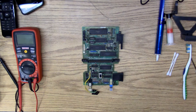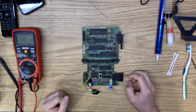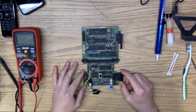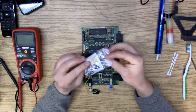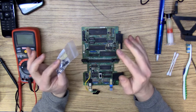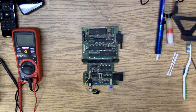After testing the board for various voltages, I'm gonna go ahead and install that capacitor kit that I got with this system and get all these caps replaced. Then we'll test it and see if that fixes our issue. If that doesn't, we will continue to replace caps in the power supply and then go from there. Let's get into replacing some capacitors.